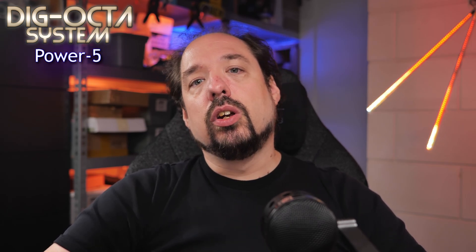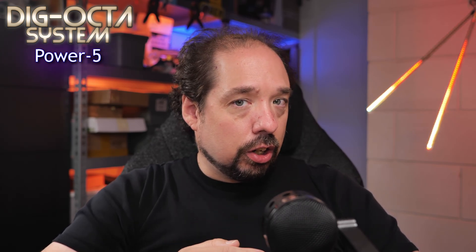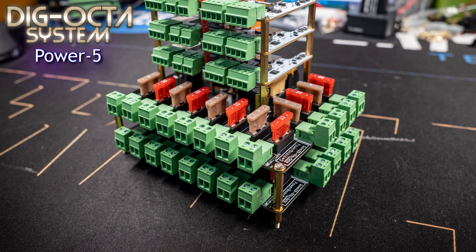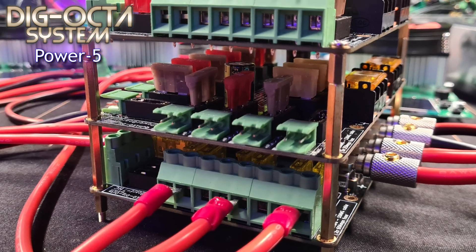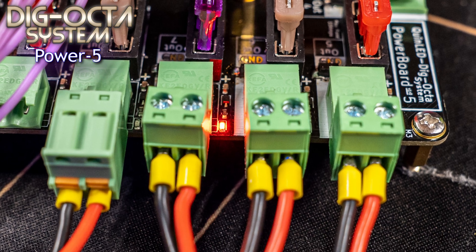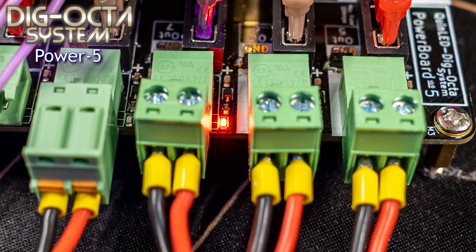The plugs that come with the board accept 14 gauge wire or up to 2 mm² with wire ferrules. The pluggable nature of the connections on the Power 5 makes the board ideally suited for stacking since all connections are accessible from the sides. Even replacing a fuse while stacked is possible with a little finger nimbleness, and the broken fuse indicator lights are positioned at the edge of the board making it very easy to detect which fuse is blown. This is a normal power board rated for up to 50 amps continuous and 10 amps per output, though at maximum current this connector style will show relatively high voltage drop and heat.